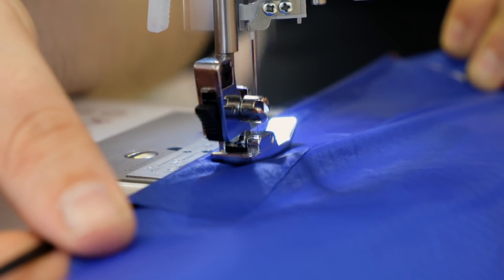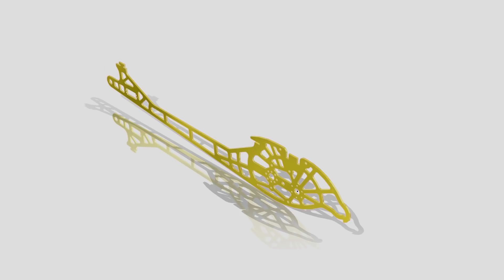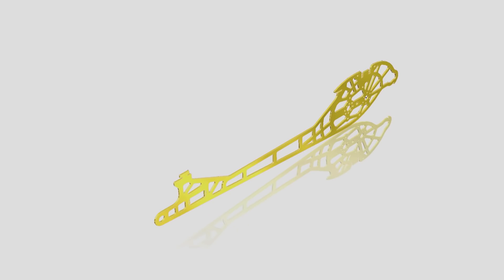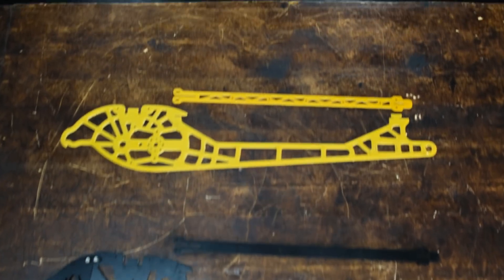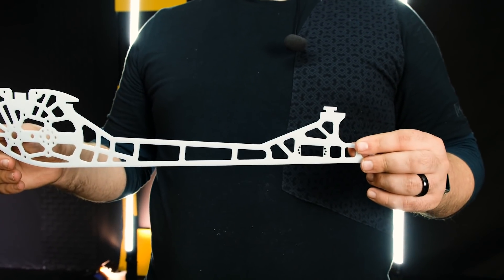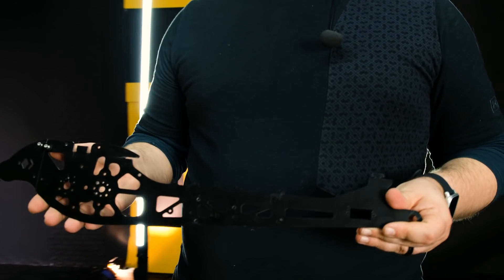Now I sewed the tail in a similar manner and installed the parts on the fuselage. Now for the body that will host other parts of my ornithopter — it is the biggest part, so it has to be as light as possible. I cut holes in it for weight reduction so it looks like Swiss cheese. There was no ready-made fuselage model for my ornithopter on the internet, so I made it myself. The snap-fit approach helped me get rid of any bolts — it is like Lego. Every piece is held in place by the slot it is inserted in. The first prototype was made of 2 mm thick acrylic resin. This material is very light and cheap in production but very fragile, so the ornithopter would break on the first fall.